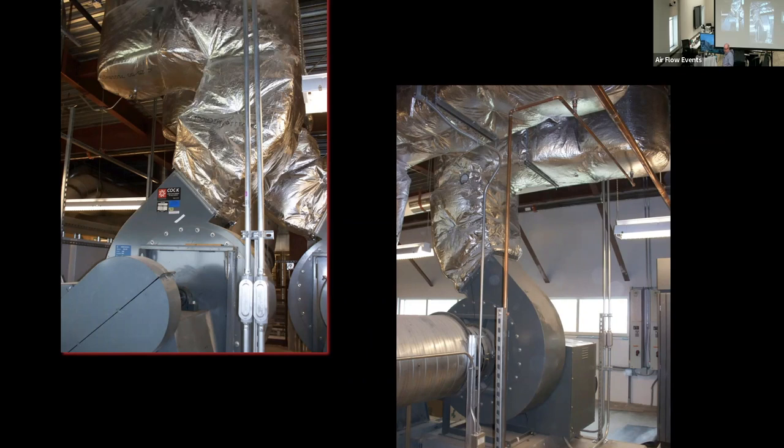So this right here, now, unfortunately, what's really frustrating is, as I mentioned, the rotation and discharge was not properly communicated. But on this particular project, some of these fans were field rotatable. So it could have been that discharge of the fan, instead of having air come here, slam back around and go from there. Quite simply, that discharge could have been rotated on that fan and moved from there. So one of the things, and like I said, I'm not pointing fingers, but that communication, not only from the design, the installation, and the provider, that's critical. That is absolutely critical going into there.